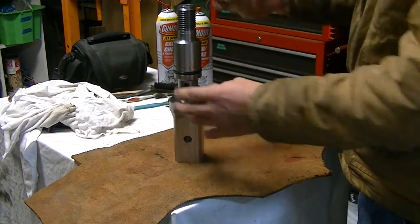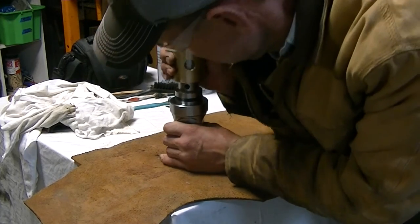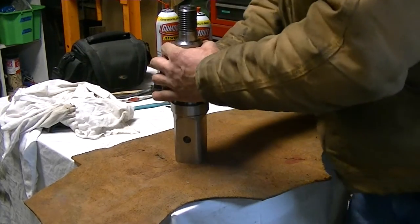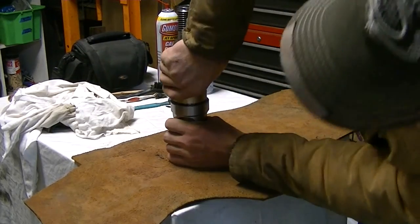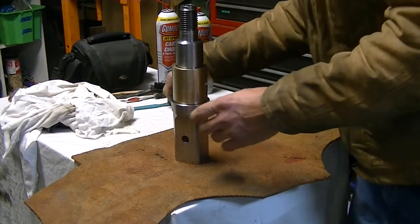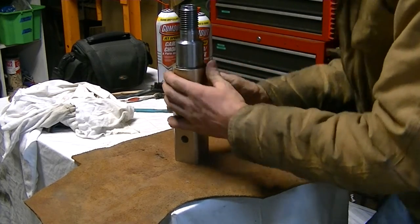The O-rings seal and keep the water going down through the center of the spindle to flush the cuttings out as the core barrel rotates, and the brass sleeve is held on with a snap ring that fits in a groove on the spindle.